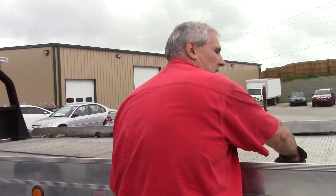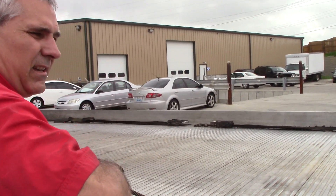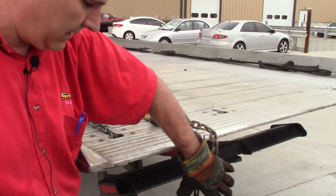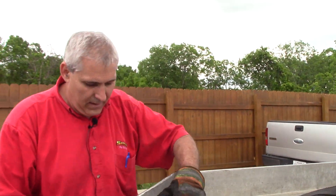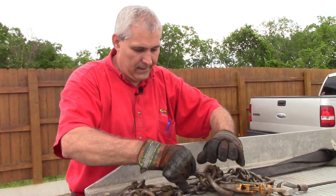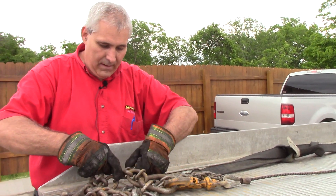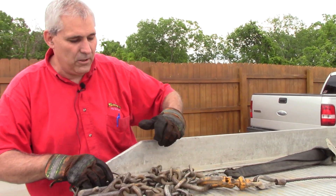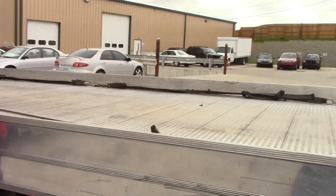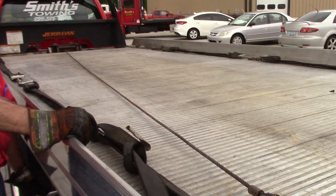I'm 6'1" and I couldn't even reach the wire rope. That's the reason I'm always encouraging you to put it on the corners. Different guys will hook into these pockets, but I've been doing this for 28 years. When you hook into the pockets every day it wears the pockets out — it creates a lot of stress on them and stretches the holes out. If you're over the edge, it's not going to wear anything out.